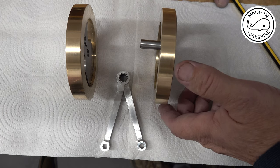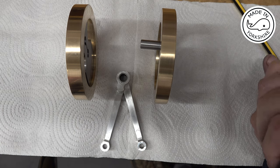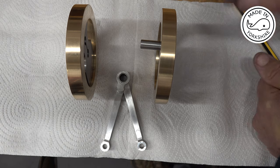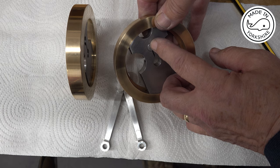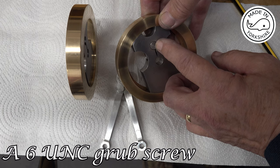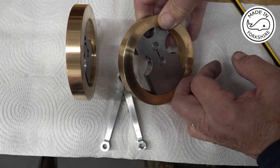I've had quite a few suggestions in terms of options. Tony Simmons came up with a great idea — a gib head key — but having thought about it, the head will stick out so that's no good. Other suggestions are solder, loctite, and maybe a grub screw between the join. I think what I'm going to do is drill and tap the join between the crank pin and the crank web, put a grub screw in there, and also use a bit of loctite to secure it permanently, then bolt it up. So I think that's the plan I'm going to go with.